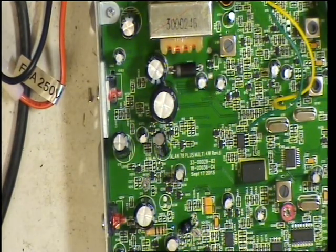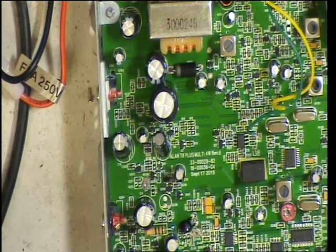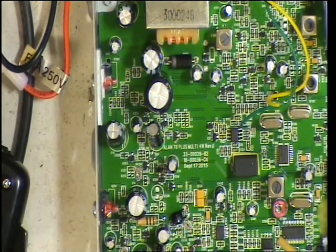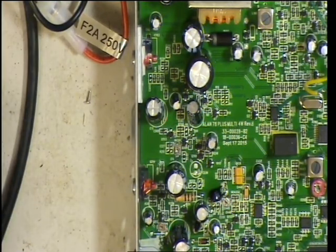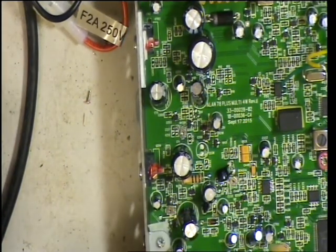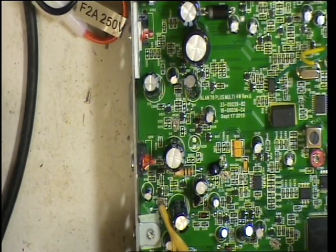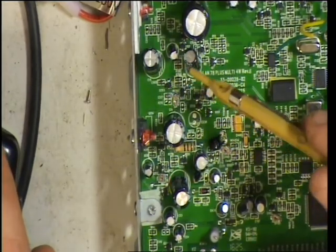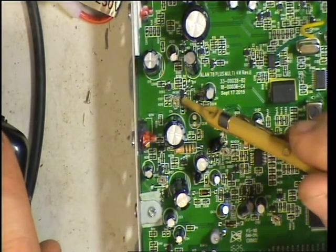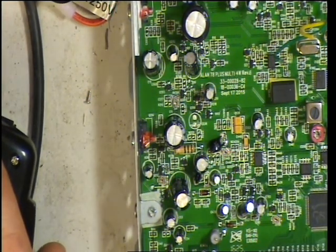If you're interested in AM modulation, AM modulation is RV201. I was telling you all wrongly — no wonder it's reading low on transmit power. The power regulator is 201... no, it's number one. RV201 is the AM mod, and RV1 is the power regulator. So AM mod is that one, and RV1 is the power regulator. I'll just make sure we're doing something like 4 watts.